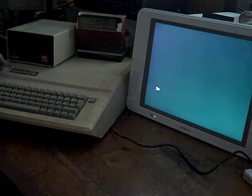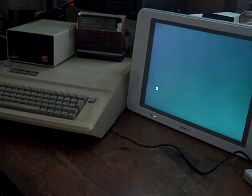One I've used in this, and I had promised someone 2 for a Dragon 32 DOS ROM cartridge. I was going to burn them 2, but at the moment I only have one spare 2764 EEPROM, so I'm sorry John, I'll have to burn you your other ROM when I can find some new ones. I will find some. I'm sure I've got some somewhere. It's just these were the only ones I found at the time. They were a bit disappointing. I've only got 2 out of the 10 that worked.